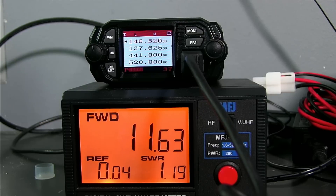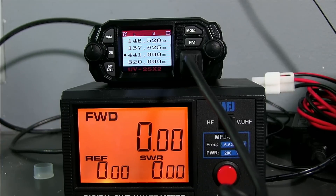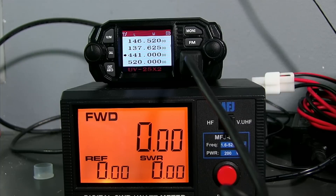It's supposed to do 10 watts on low and 25 watts on high. On 146.52 — the national calling frequency for 2 meters — we've got almost 12 watts, 11.8 watts on low power. KC5HWB testing. Now going down to the 440 band, also on low power, we're getting about 8.5 watts. KC5HWB testing.